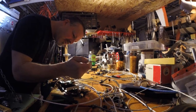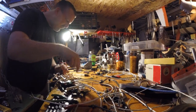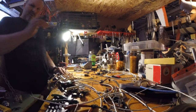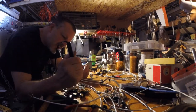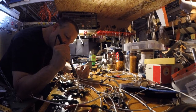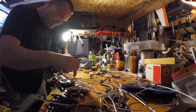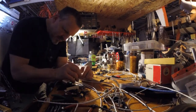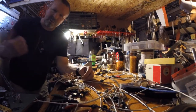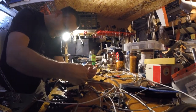So actually it kind of made it a little simpler when I was doing the trims. I could use essentially the four lead shielded line, then use the shield for the center taps for both the throttle and rudder trims, and then use the positive and negative side for the individual wires. So this way I could just utilize the individual cable essentially for five lines, and it worked out beautifully. So this way I've got it all hooked up the same way on the bus bars. I should be able to get everything all set up.